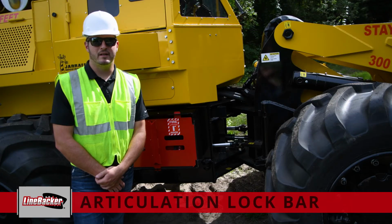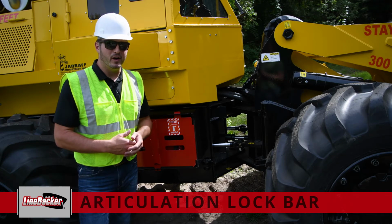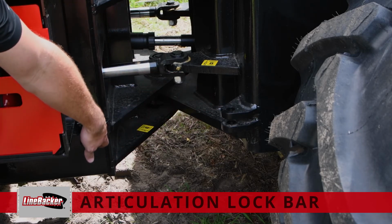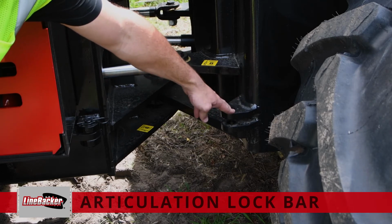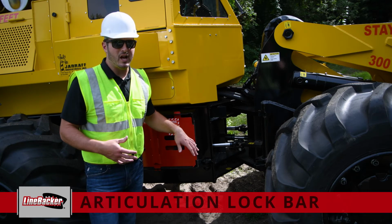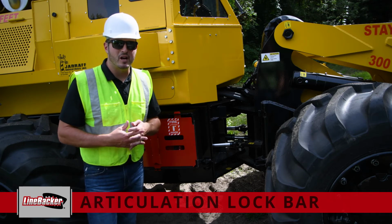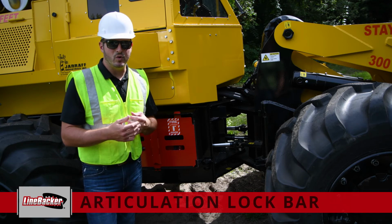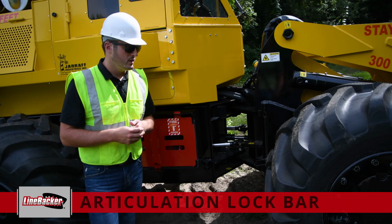On the right-hand side of our chassis articulation area, we have our articulation lock bar. That is pinned in place while in operation, but it will swing over to this flange when we are trailering the machine. You want to get the machine on the trailer, get that articulation lock bar in, and then safely tie down the machine. The reason that we use those articulation lock bars is that if you're hauling it a long distance, it has a tendency to work a chain loose if that lock bar isn't in there. That's for every single articulation machine there is.